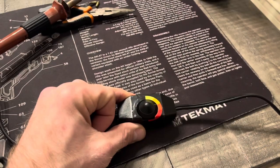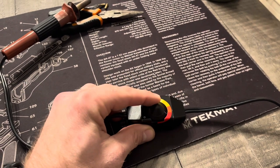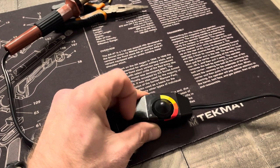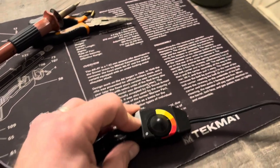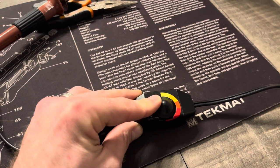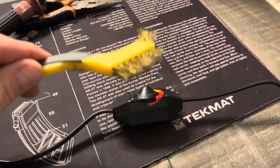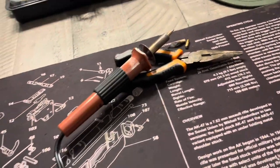One thing I forgot to mention: the heat. I put my heat on about the mid-level. If you put it too high, it melts and turns stringy. If you put it too low, you either have to hold it too long or it doesn't melt the plastic adequately. Also, you will always get a little bit of stringiness, so I recommend having some kind of little brush to clean the head of the tip off every little while.